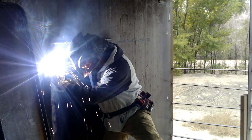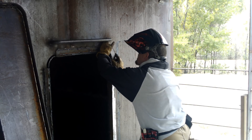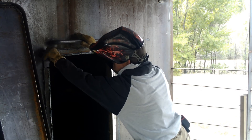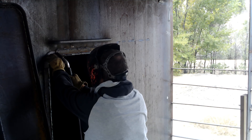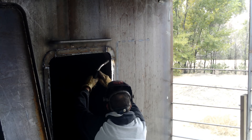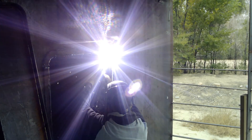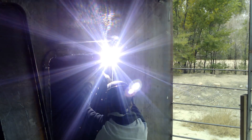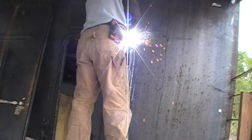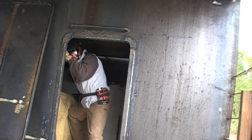Everything wasn't perfect and there were some gaps along the outside edge of the knife edge at station 30 — the bulkhead. So I added some inch-and-a-half by quarter flat bar all the way around the outside to fill the gap. I was also intending to do that anyway to stiffen up the section where the door connects to the bulkhead. Whether it's required or not I don't know, but it was worth it to go ahead and install.